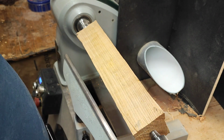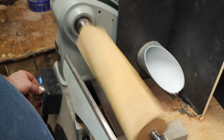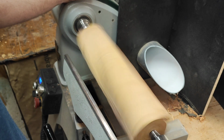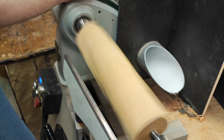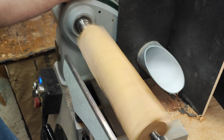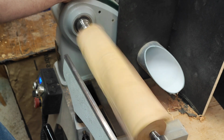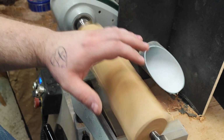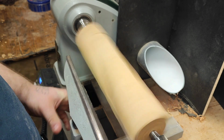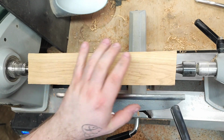Another thing that I want to point out, which is quite important, and that is the sound. Now listen to this. Now if I tighten the stock, the spindle, that's fully tightened now. If I loosen it, can you maybe hear the change in pitch? And now even more. So that's now wobbly, so that's loosely on there. So I tighten just a little bit. You'll see at the end why the pressure of the tailstock is important. You don't want to put an extreme amount of pressure, because if it's too thin of a spindle, you can bend it.